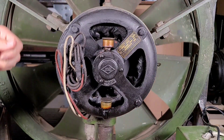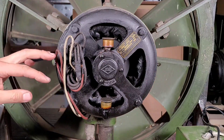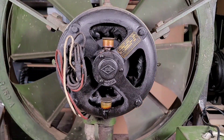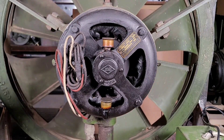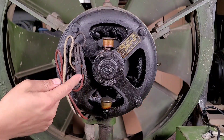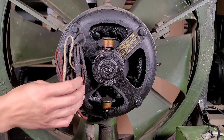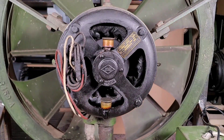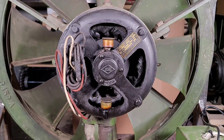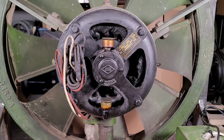What I'm going to do is heat them up with a heat gun and hopefully it'll soften that insulation enough where I can stretch these out and cover them with some heat shrink tubing. I just want to separate all these joints. I don't know exactly how they're joined together in here, but it's wrapped with friction tape so that'll be very interesting to see. I'll probably eventually change out this line cord that goes through this armored cable.